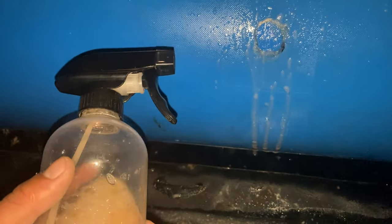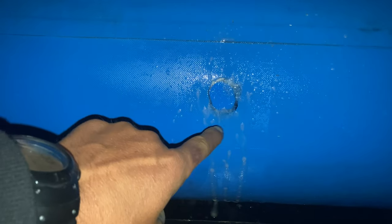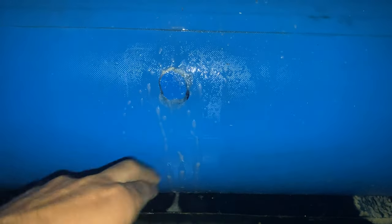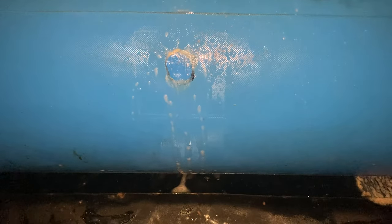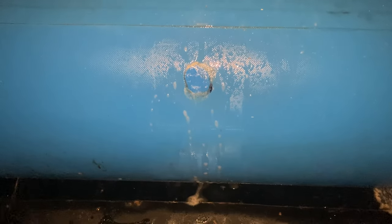Patching a hole in the boat is super simple and easy. All you need is a Sharpie, a bottle of soap, a clamp, and your repair kit. Spray soapy water where you think the hole might be, watch for bubbles, dry that spot off, and mark it with the Sharpie. Deflate your pontoon, put glue on the boat and on the patch — making sure the front of the patch matches the texture on the outside of your pontoon. Clamp it or lay something heavy on top. Mine dried in 11 hours, but instructions say 24 hours. I apologize for the shaky camera — I didn't use a tripod. If you have any questions about repairing a hole on your vessel, leave a comment below or reach out via my social media platforms.